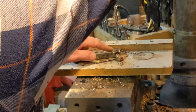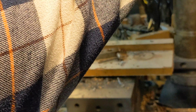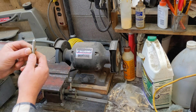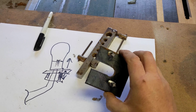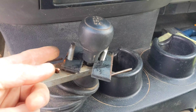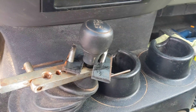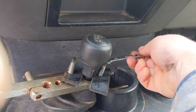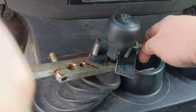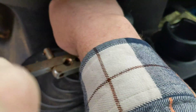Here I'm drilling just a little dimple into this so that the threaded rod will tend to center on the dimple instead of sliding out. There it is — let's see if it works. I had to take it back downstairs and shorten these pieces of all-thread a little bit because it's snugger than I expected, but it's nestled in there now. I think I can just sit and alternately tighten these bolts and it will come right off.